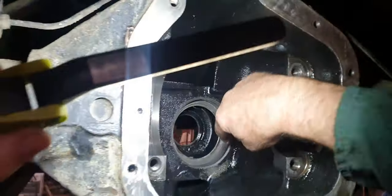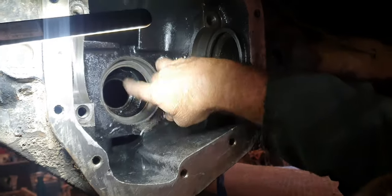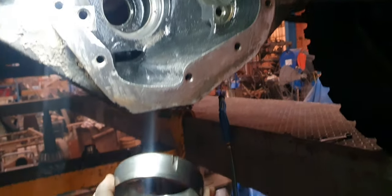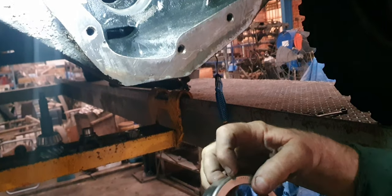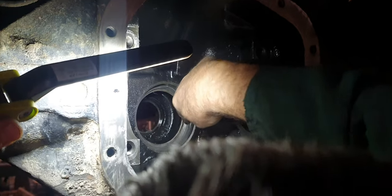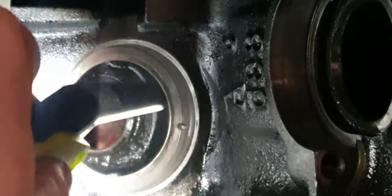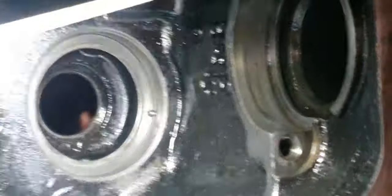This bearing is gradually turning in here. I've made a Scotch key to stop that rotating, because the shims can start spewing out and chewing up. You grind a channel in the bearing, drill and tap a hole through the side, back from where all the shims are. Got a socket head cap screw in there — put a hexagon bolt if you want. See the pin down there? That pins it in. Simple method.